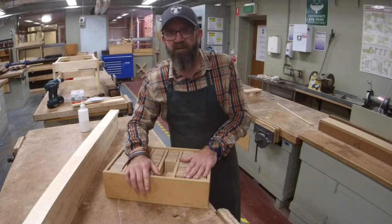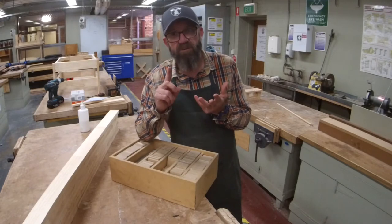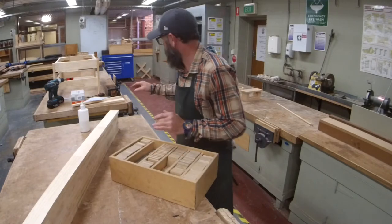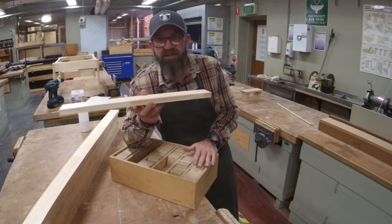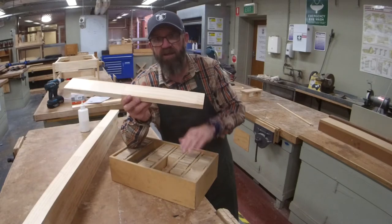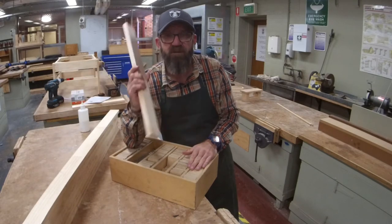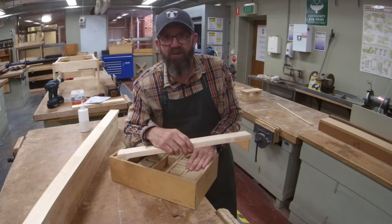All right. For this bit, Brocky's gonna help me out. You need your glues, your drills. Make sure the screws you use, because we're attaching the 2 500 braces to our 1200 pieces, are the right length. The ones we use are 35s. All right, we'll get into it. I might play a bit of rock music through this one for you.